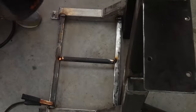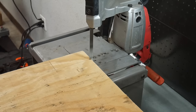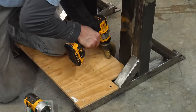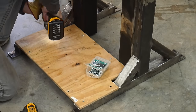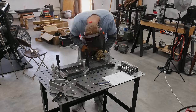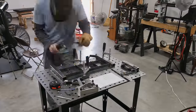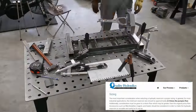Here I'm welding in a small frame at the bottom using eighth-inch angle iron and a piece of half-inch plywood to hold the hydraulic reservoir. I'm buying a new reservoir because the old one probably has moisture and rust in it. Also, the older reservoir was five gallons, and given the gallons-per-minute output of my pump, I thought a ten-gallon reservoir was more appropriate for this press.